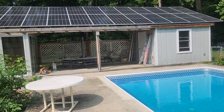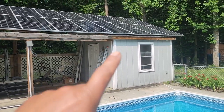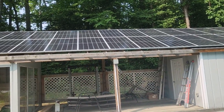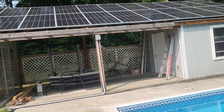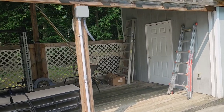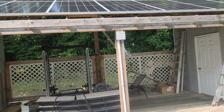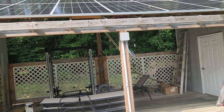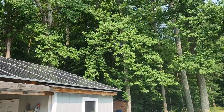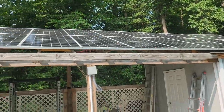The way this was built, the intended purpose for this particular structure was to have a roof over this edge so I can put these panels up, because all I want is shade and to keep some water out. It's your standard six-by-six post, four feet in the ground. The pitch of this roof I ended up doing about 30 degrees — as close as I could, with the highest pitch possible while still being able to clean it, because with all these trees I knew I'd have to clean a lot.